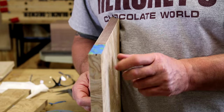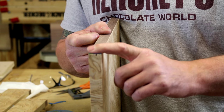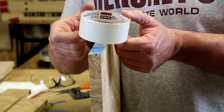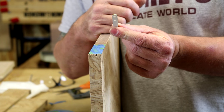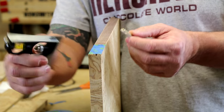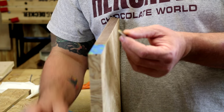Let's get started on these hinges. First thing is put the door in the vise, take a piece of blue painter's tape and lay it down, cut it so it's flush all the way around. Then take some two-sided carpet tape and attach that to one side of the hinge. Take the adjustable square and find where you want to place the hinge on the door.